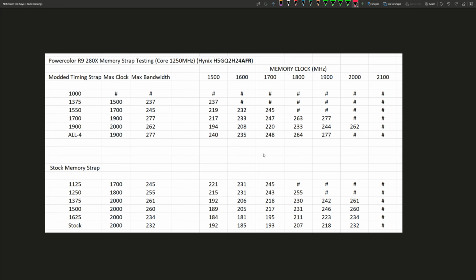There is a little bit of voltage scaling in it, only a little bit, nowhere near what Samsung does. Samsung chips usually scale very, very much with voltage. This one doesn't scale that much, but there is a slight difference. I can't say anything about cold scaling on these. I have a feeling it either doesn't care or you have to take it really, really cold for it to matter. So I'll say something if I find out something.